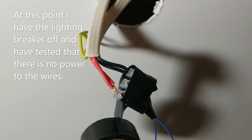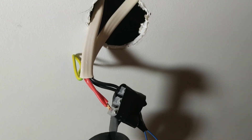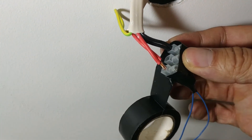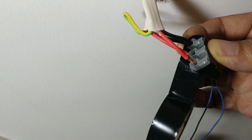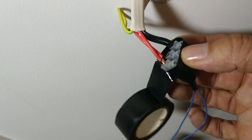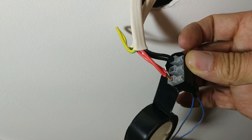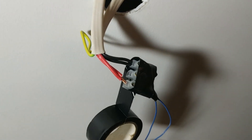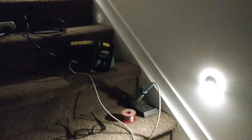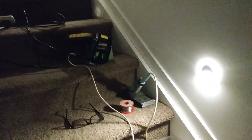Something else I've just found — as I've been going through replacing all the chips, this light here: I replaced the chip and it still didn't work. So I pulled the unit out and discovered that the electrician had not really screwed the wiring connector in properly — it was just sitting there floating, probably arcing. Didn't check his work. I'm not that impressed with whoever the electrician was in this house. Anyway, another thing to fix — at least I found it. All of the wall lights are done and they're all working. Another job done.